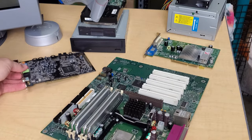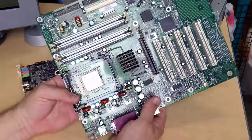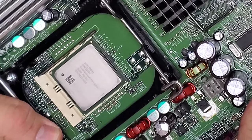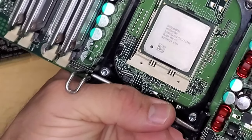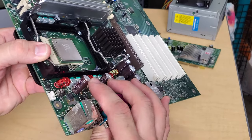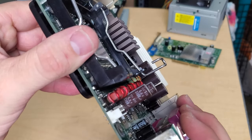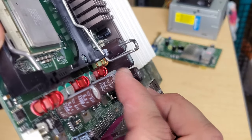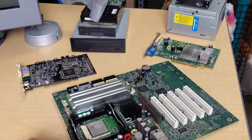Here's the graphics card and the Sound Blaster Audigy SB1394 sound card - it's also been cleaned. Here is the motherboard; I've already repopulated the RAM and the CPU, which is an Intel Pentium 4 2.4 GHz processor. The real issue on this board - it looks spotless and brand new except for two capacitors right here that I showed you earlier. If we can get in close, they're not flat anymore - they're cone-shaped, like an ice cream cone.